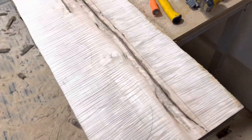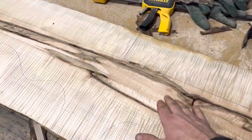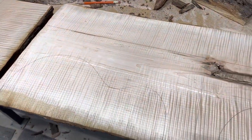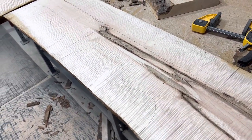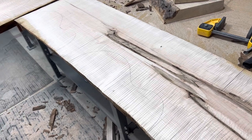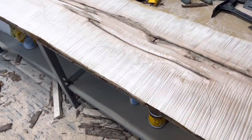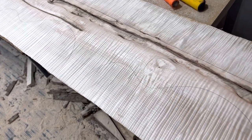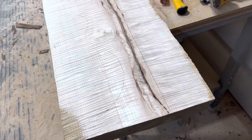Because I'm able to squeak out a neck blank here — top, top, neck blank — this is all junk in the center — top, neck blank. If guys like me didn't know how to, one, read the log, and two, map out these boards correctly, you run the risk of going out of business if you do this over and over again wrong. It's really important — if you ever see anything tapered, that is why.